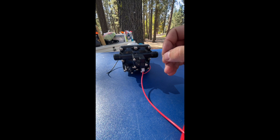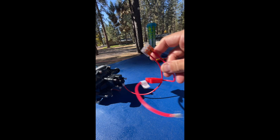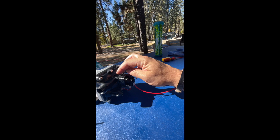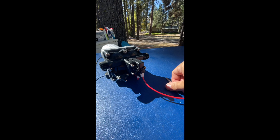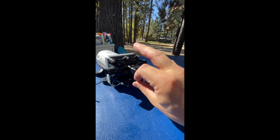So the first thing to do is to take these three screws apart and take it off, and I'll show you how it looks. What you have in front is your electricity going in, going into a little check. This is not just a check valve — it also monitors pressure and will turn the pump on and off when it gets to max pressure. So there are two things. You're going to take off the three screws up here on top — I already started taking them off.